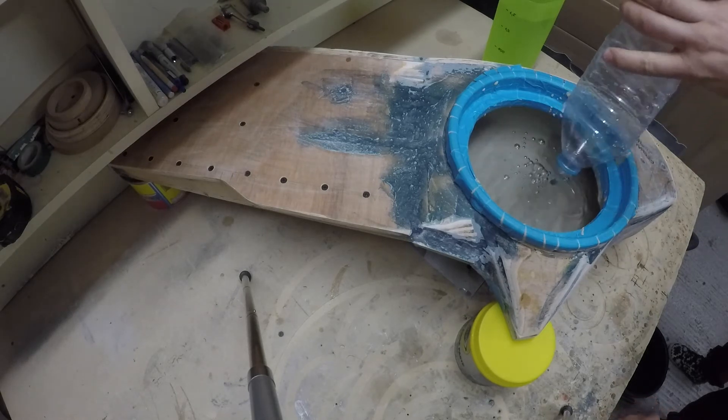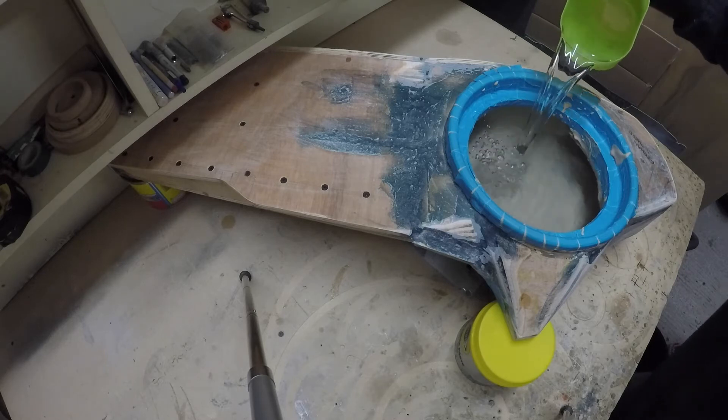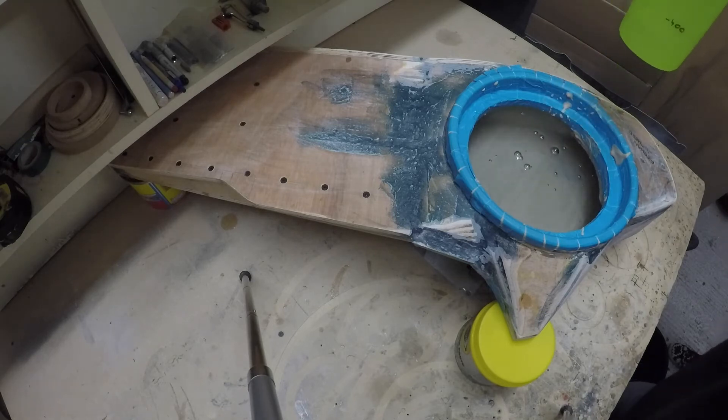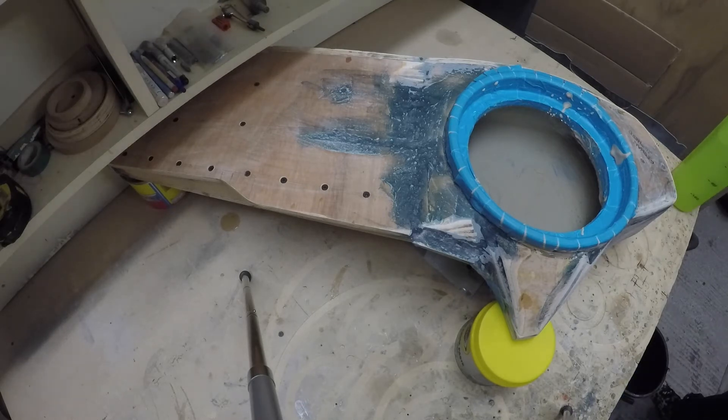We have 12 liters in and there's about an inch left from the water surface to the top. Now it's getting close and I've reached the bottom of the ring. There's 0.2 liters left from the 13.5, so that's 13.3 liters - happy days! I was aiming for 10-11 liters which would have been fine for the driver to achieve the 0.7 QTC factor. With 13.5 liters our QTC will be a bit lower, so F3 will be better and the speaker will play a bit lower.